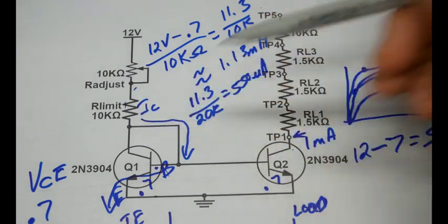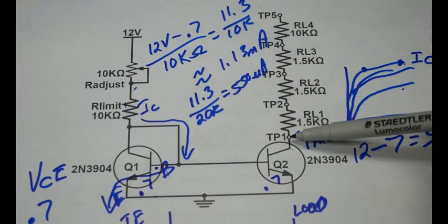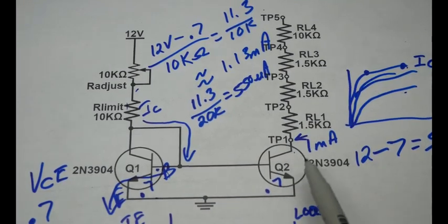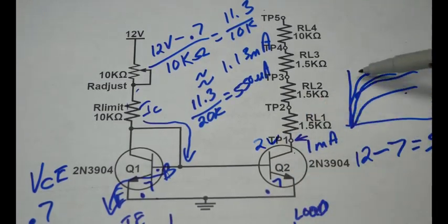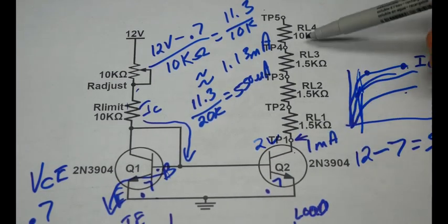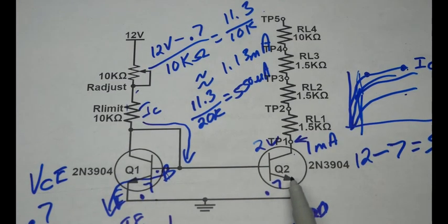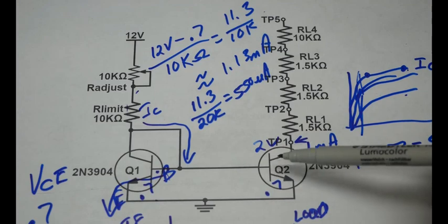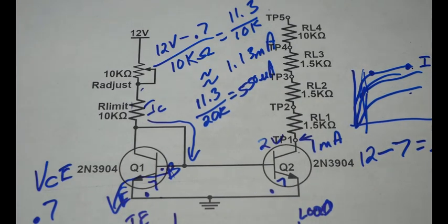We have our 12-volt supply. We fix the current at 1 milliamp here and 1 milliamp here, give or take, because the Early voltage is going to have a big effect on how much current actually goes through each device. We have anything from probably about 2 volts minimum VCE here before we start dropping into the resistive area — the danger zone at about 1 volt. Two volts is obviously not the same as 0.7, so we're going to have a difference in the effect of that Early voltage. Fewer charge carriers over here will cause differences in the values. So let's go ahead and look at the circuit and see if we can get it to work the way they say it should.